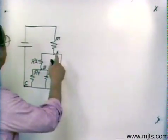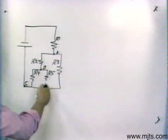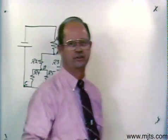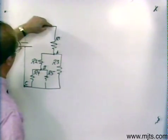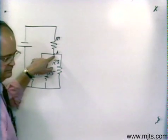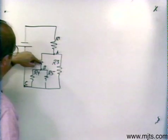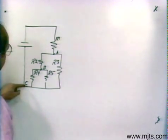You'll see that we have resistors one, two, three, four, and five in combination. They have a question: at what point does the current first divide? The full load current would be up to the point that it first divides, and that would be right at point A. Then they ask at what point does current next divide — that would be at point B. And then of course it would all come back for full line current right at point C.